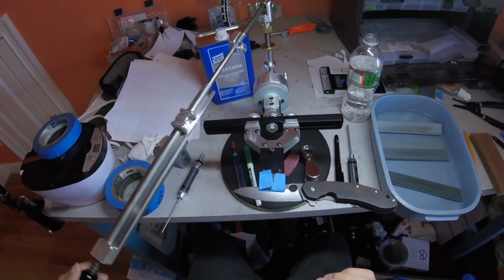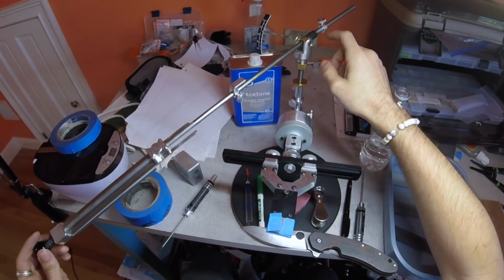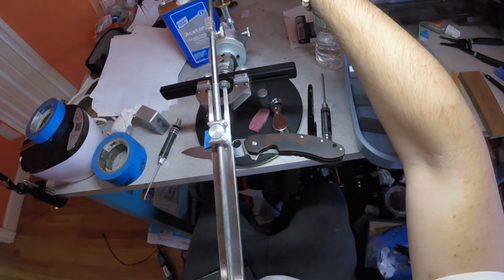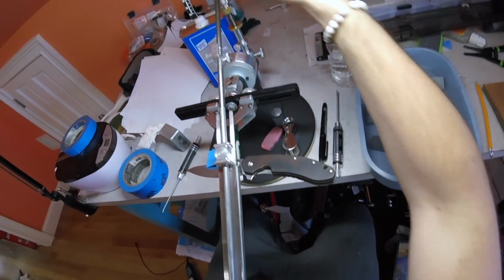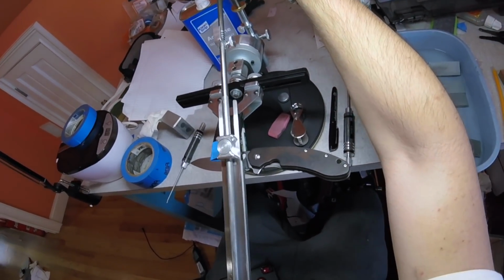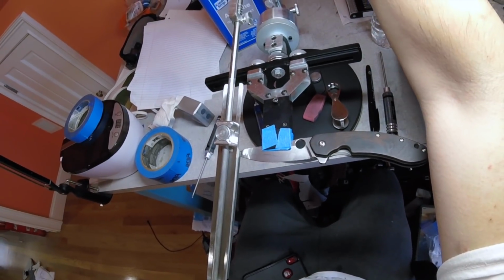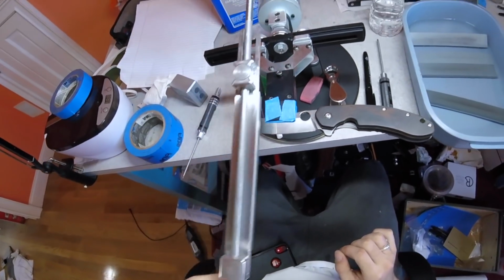And how you avoid that, you can see here, I have a stop collar on either side, right? The TS Prof actually has these little springs as well. But what you do is you loosen it on one end. I don't want my stone to slip off, right? So come to right about the end, snug it up. Now check, will it come off? All the way to the tip. See the tip, it will come off. So I want to come back up and tighten it there. Right, now this isn't coming off. So I won't slip off this way.